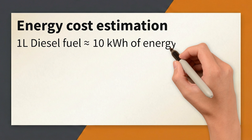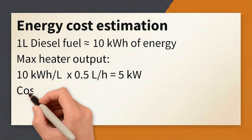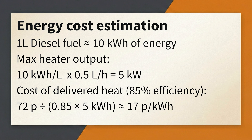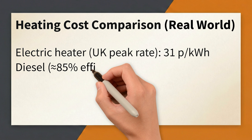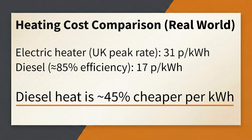It's harder to work out the real power of the diesel heater. Both heaters are supposedly 8kW, but in reality they are a lot less. Diesel fuel has around 10kWh per litre, so the most this heater can produce is actually 5kW. Assuming we realistically get 85% of this theoretical output, that's around 4.25kW. So the actual cost per kWh is 72p divided by 4.25kW, which equals 17p per kWh. In simple terms, at typical settings, the diesel heater costs roughly half as much per kWh as my electric panel heater here in the UK — and you might be able to get kerosene cheaper, which these heaters also run on perfectly well.